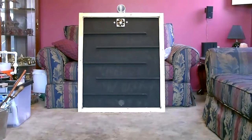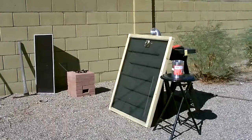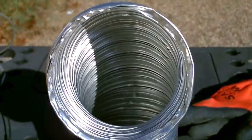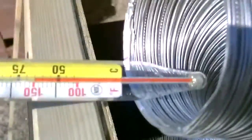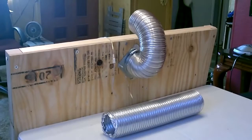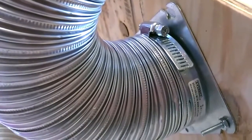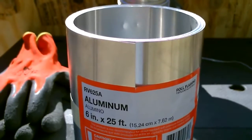And finally the channel solar air heater — no metal at all in it. It got to 120 super fast, and that was more typical 150. If you really want to go all out, add some material — just cut down some pieces and tack it in the channels. You might get 10 or 20 degrees hotter, maybe more.